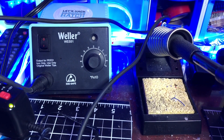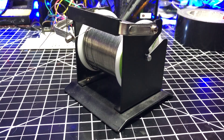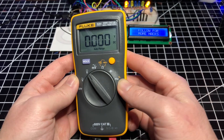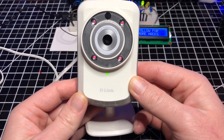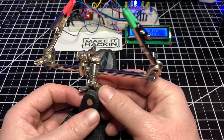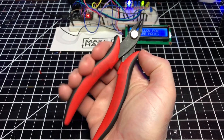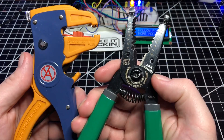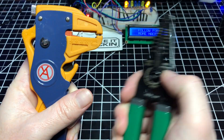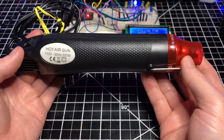And here are the tools you will need. A soldering iron — I use a Weller WES-51 soldering station and love it. Solder — I enjoy using thin solder for electronics. A multimeter — I'm using a Fluke 101. This tool is optional but extremely helpful when troubleshooting continuity and DC voltage. An infrared security camera — I'm using a D-Link 932L. This is optional but very helpful for testing. Helping hands — this optional tool is extremely useful for soldering; its alligator clip hands hold onto small things while you're busy holding the solder and iron. Flush cutters — used to cut small things or even strip wire if you have a steady hand. Wire strippers — either automatic or regular style, used to strip the wire you'll be soldering. And finally, a heat gun — used for heat shrink. If you don't have a heat gun, you can also use a soldering iron or lighter to shrink the heat shrink. Just be careful.